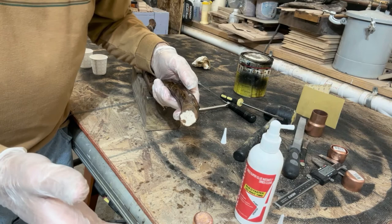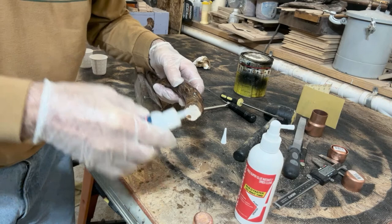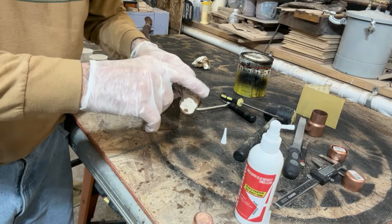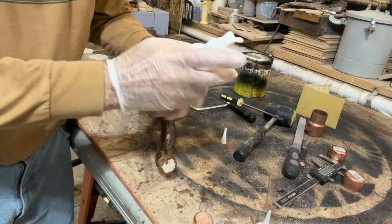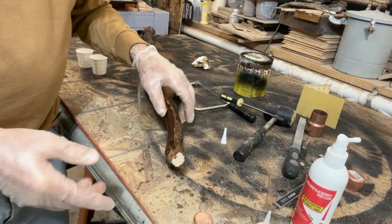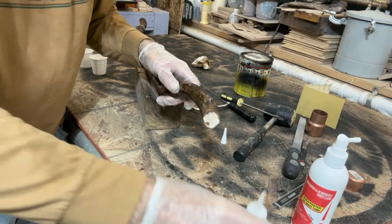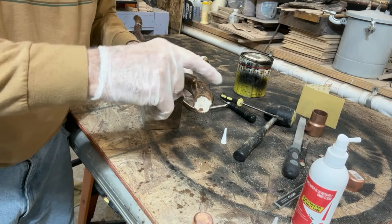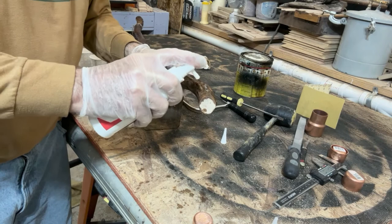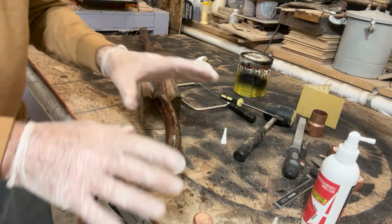When you have just a little bit of an area to cover, I use CA glue — just put a small drop on there. That'll put a clear coat that matches the rest of your epoxy; let it run down a little, then mark it with your finger and spread it just a little with your rubber glove. Then put a little accelerator spray on it and it's done. If it doesn't shine quite like you think it should, put another little drop on, rub that in to build up the coat, hit it with accelerator, and you've got it.